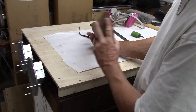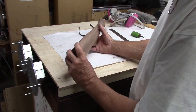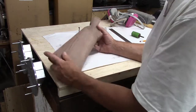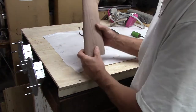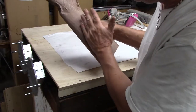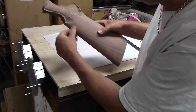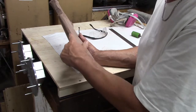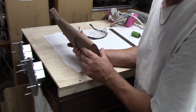But I used the slack side of the belt sander with 80 grit, and removing that much material, you can't help but make the lines wander. So every now and then, mainly the top, I put it on the top side of the belt sander to flatten it out a little bit. I didn't want to lower this down, just carefully rolled it back and forth and tried to maintain this line fairly straight. And in fact, I still have some of the rough carving marks, so I know I have more I can go down. So it's really not quite finished, but pretty close.